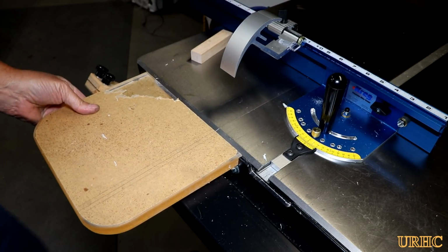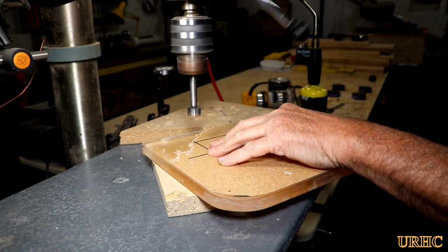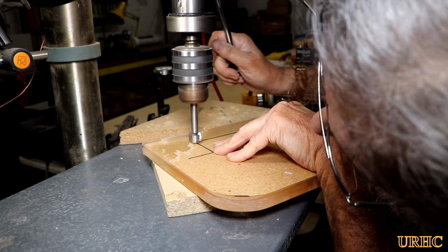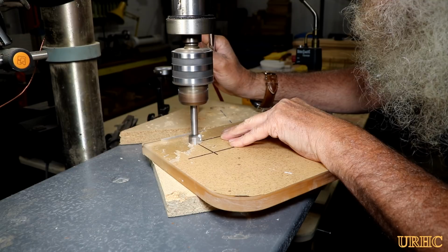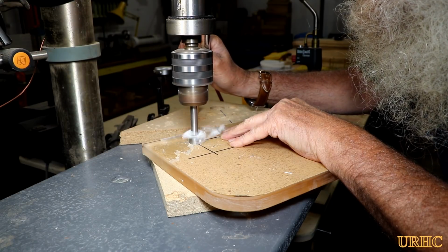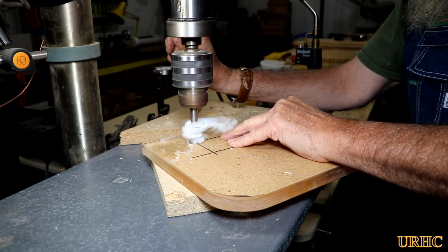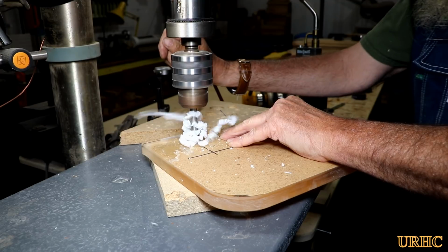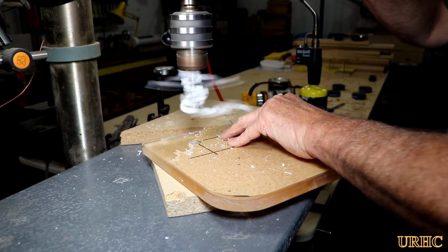And I never use the fence on that side of the saw, so it won't be in the way of anything. So then I marked out some mounting holes that I was going to put into that top rail of the tubing for the fence there. And just the first thing I had to do was just counterbore a couple of holes. And again, here I just used the old wood-boring Forstner bits, and they drilled the plastic just the same as they would drill in wood.